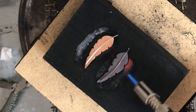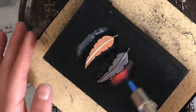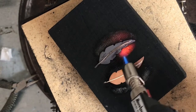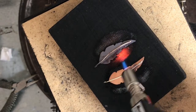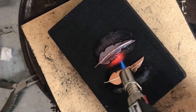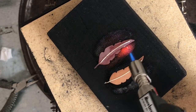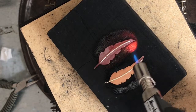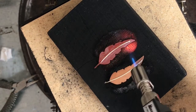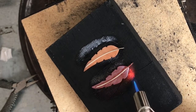As I see that glistening, that's when the solder is going to start flowing — sometimes it's hard to see. One thing I know is that if I see that silver start to glisten and I'm not putting the heat directly on it, then I've definitely got that solder going. Then I want to back off just a hair because I don't want the silver to really melt. I'm just going to hit this from both sides, going back and forth.